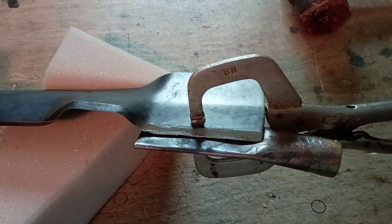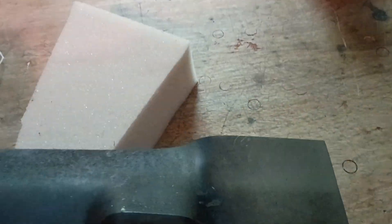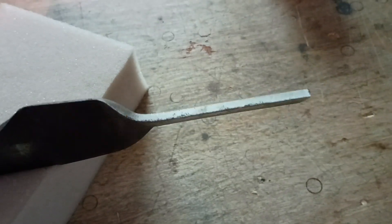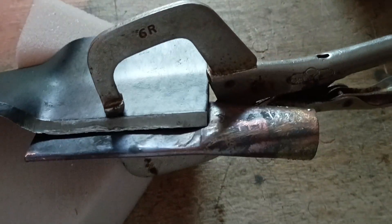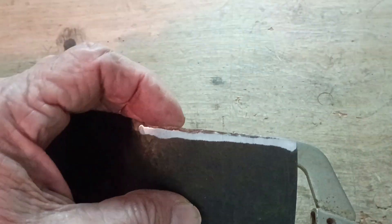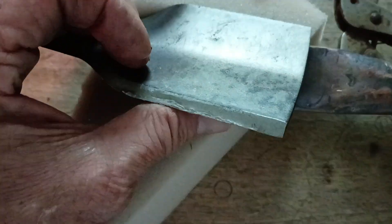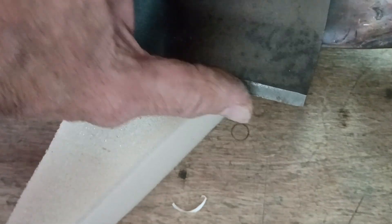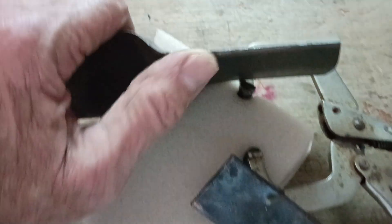Here's my hardened heat-treated mower blade. This side hit a rock and got really hammered and mushroomed out and bent over. This other side missed the rock — it's got a couple little chips but still not too bad of an edge, so I'll clean that up. I took my ball peen hammer and on my anvil I hammered the bent, mushroomed-over edge back down. It's got a pretty good edge right now — you could probably just throw that back on and start mowing.